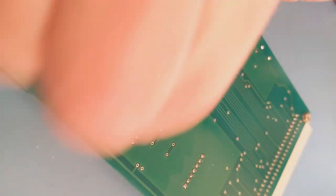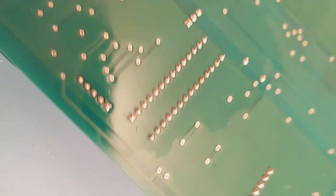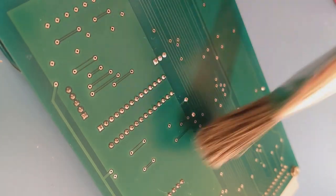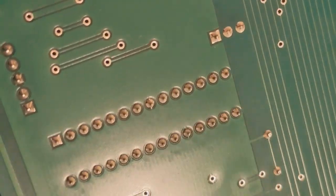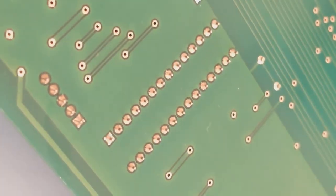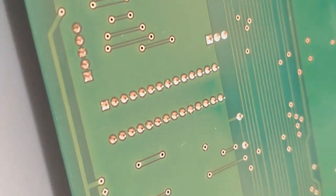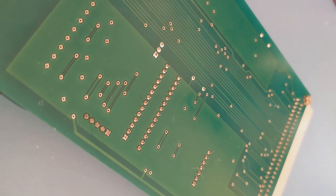I'll just go right around the outside. As you can see there's still some smearing, so I'll use the hairdryer again. You can see all that evaporate. If you get any little fibres, these cloths are really good for not leaving fibres — you can just brush them off. And as you can see you've got a really clean joint, all around, no flux at all anywhere. So that's a really good method — dipped cloth in Ultrasolve with the G-Tech dry wipes. I'll put a photo up later where you can get in touch with them if you need some.